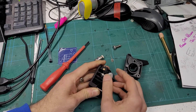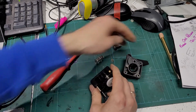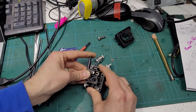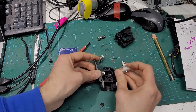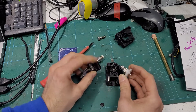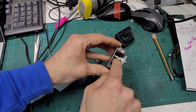That creates just an extremely fine guide either side of the filament path and it generally tends to work. I'll show you how to do that. You might need to do a little bit of Dremeling at the end just to make sure that when it pivots in it pivots all the way in and it's not hitting little bumps of material, so the gears mesh properly.